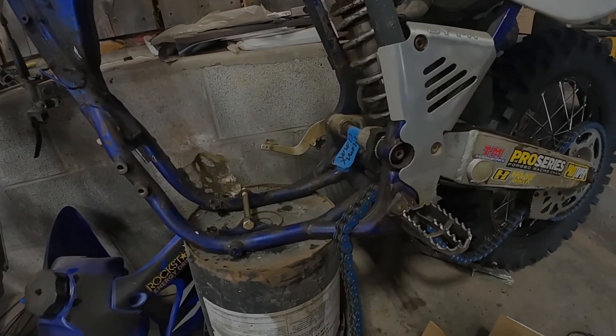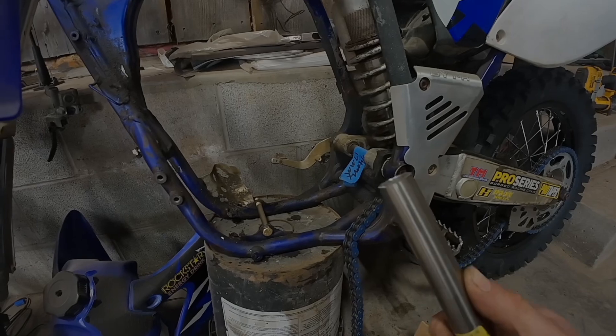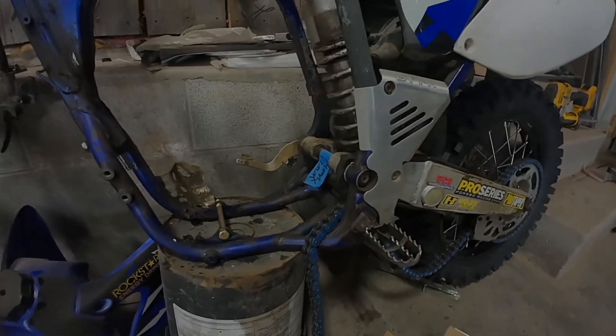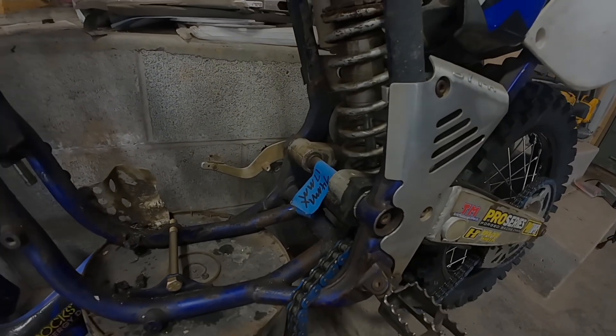The starting point is right here. When I machine this, I'm going to machine it with an interference fit — I'm going to freeze one piece and heat the other, then slip them together so they fit nice and tight. It could be a giant pain, but we're going to give it a shot and see how it goes.